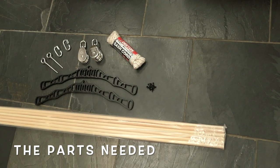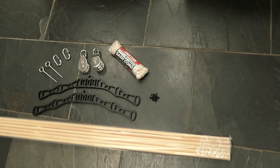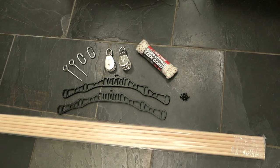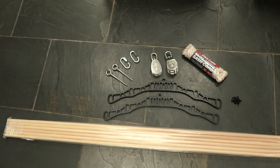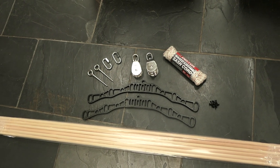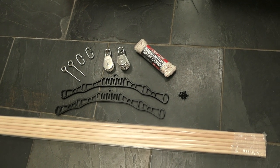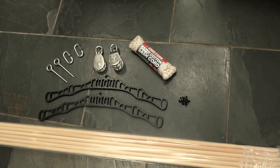These are the items I'm going to be using. I've got six wooden slats — I'm using 1.5 metre lengths. I've got two cast iron rack end retainers. I'm using sash cord as this looks really nice and it's very strong. I've also got 12 black screws, using 3.5 by 32mm screws.